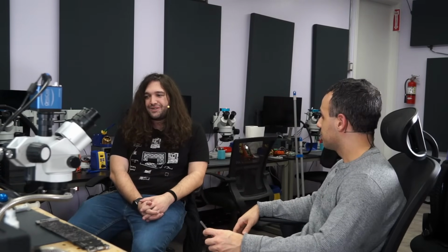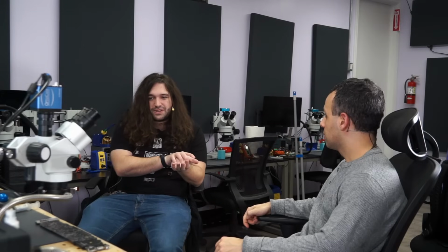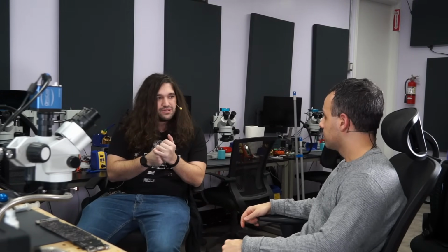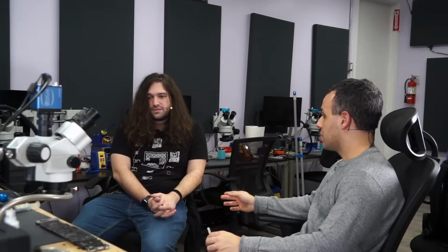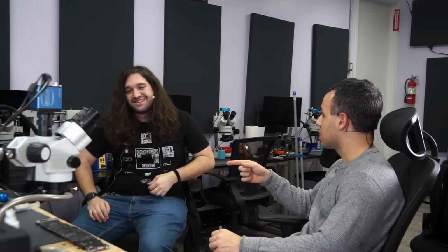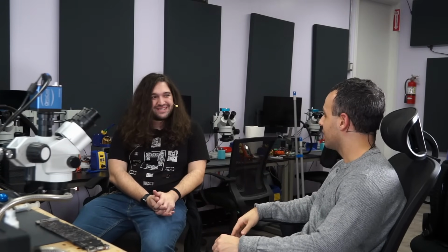Yeah. So for working on boards like this, is this the most common type of issue you see at this point? Like corrosion and liquid damage. Yeah, it's just easy repair, depending on the model of the board. Some of them, it's just an easy peasy 3-volt circuit that doesn't work. On some boards, the liquid always goes where something turns 12 volts into 1 volt for the CPU. Okay. Those suck because it's the exact same thing, it's just that the CPU got 12 volts every single time, right. And they don't like that.